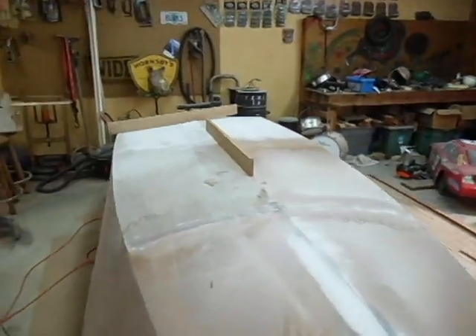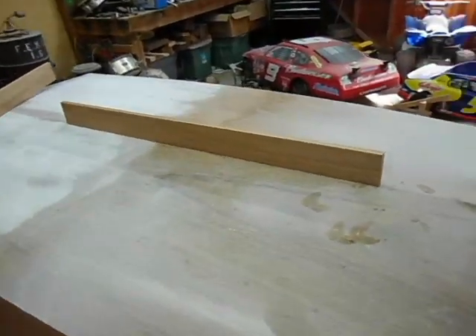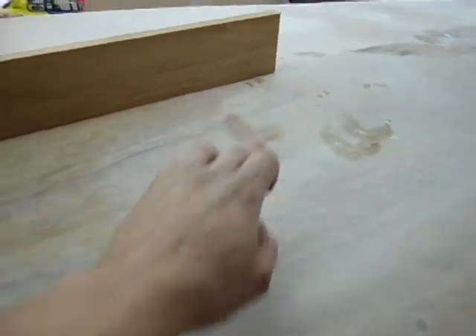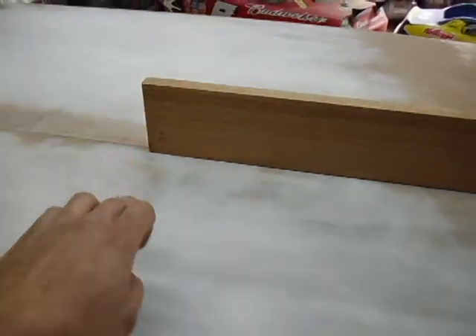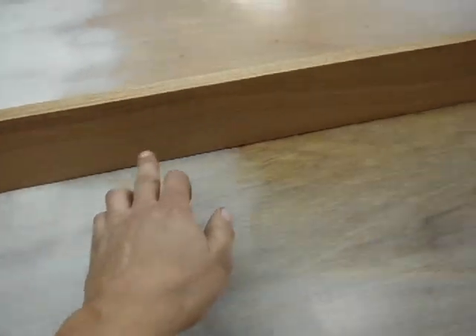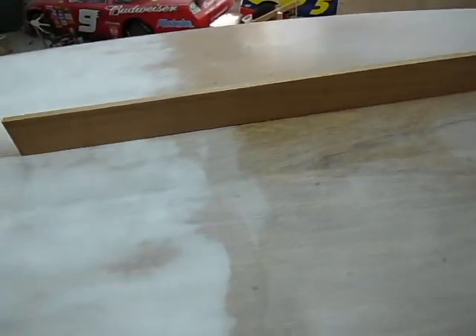We're working on the center skeg today. I've got it sitting on the boat down the center line but it's not attached, and this isn't its final shape. On the leading edge it'll be an inch tall, on the trailing edge it'll be two inches tall, so it'll be a gradual taper. I'll round the nose over and round the back over so there are no hard square edges. I'll counter-bore it down with about nine screws throughout its 48-inch length. It's African mahogany, just like all the frames — a center member that's going to help the boat track and steer and not want to skid out in corners. I plan on towing my kids on tubes, so I want it to grip the water.